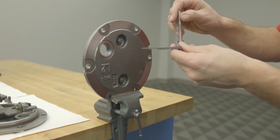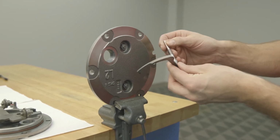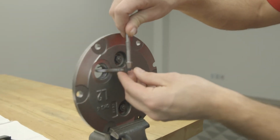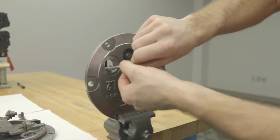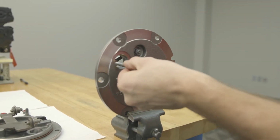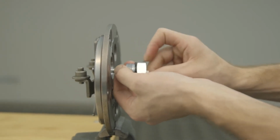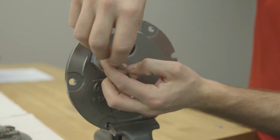First, we will show how the tool interacts with just the side cover and its components. Insert the boot of the wishbone into the pump like this. Then rotate the tool towards the guidepost closest to the drain port. When the tool is properly oriented, the post should stick out through the center of the drain port. Install the wishbone locating plug over the post of the wishbone and secure into place with the nut.